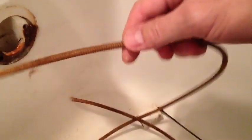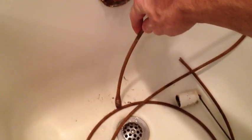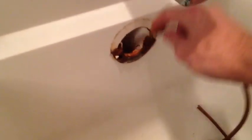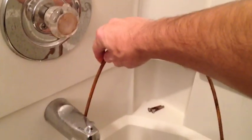Make sure that you get enough of the cleaning rod down into the pipe so that you're actually going down into the trap. You have at least maybe 12 inches from here down, and then I'm going to have to go down probably another 12 inches to actually get around the trap. So I'll fish that down there — I have to go down at least that far plus another 10 to 12 inches to make sure it's down far enough.